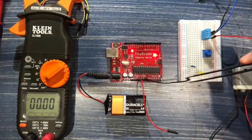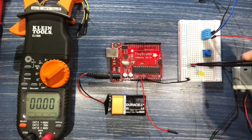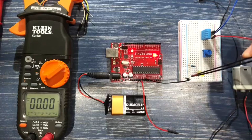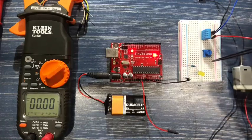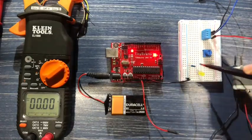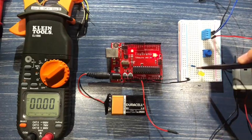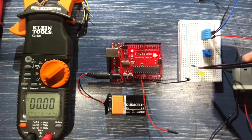So what we're doing here is we're taking ground, connecting it to the negative rail, connecting it to this resistor just to hold down the current a little bit, because we don't want too much current to flow through this LED or we'll burn it. It's the only thing this component is doing right here. So 0 volts going through this rail into the resistor, and from the resistor, which is actually on row 25, column C, as in cat, everything that's 25, C25, is also connected to D25, as in David. So the LED, one of the legs of the LED, is connected to D25. That means that the resistor is connected to the LED.